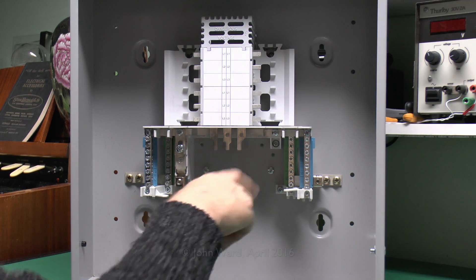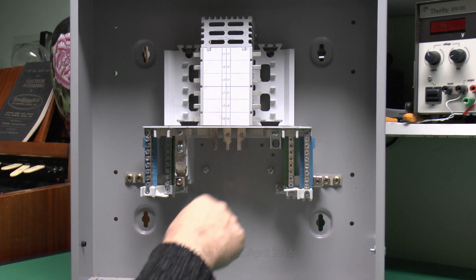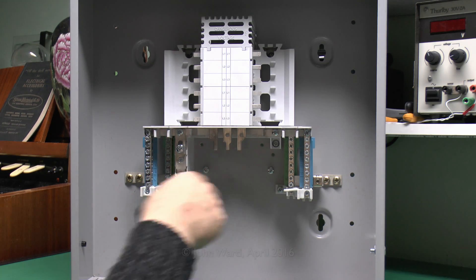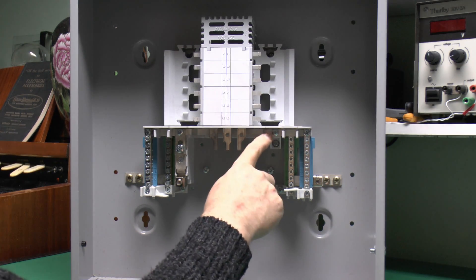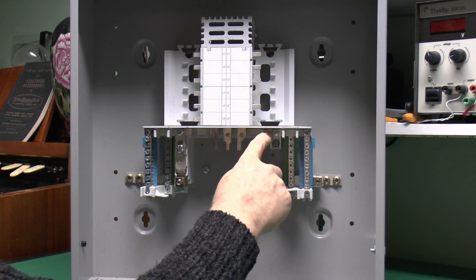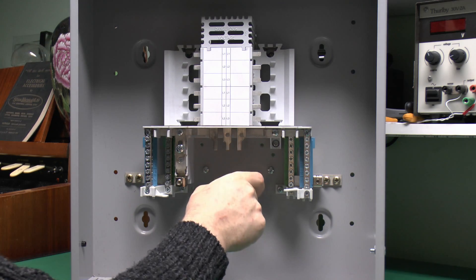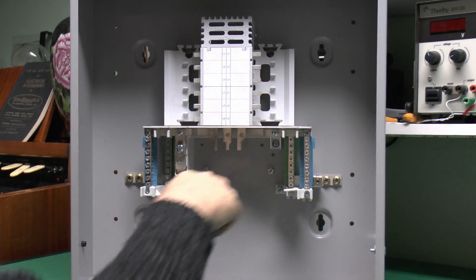As well as a three-pole isolator, you can also get a four-pole isolator, and it fits in the same position — you've got the three tabs there for the three phases. With the four-pole, rather than the neutral going directly to the neutral connection, the neutral would actually come into the fourth pole of the isolator. It comes with an accessory piece which bolts onto this fixing and provides a fourth tab, so your four incoming wires — three phases and neutral — just come in the bottom.